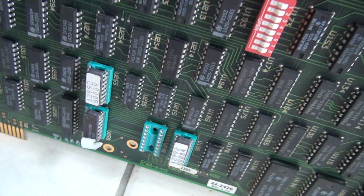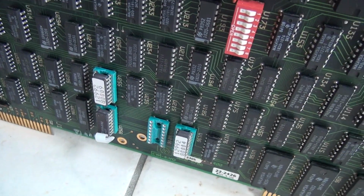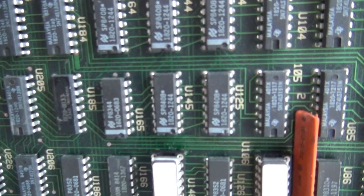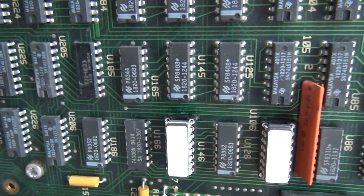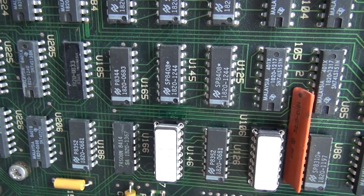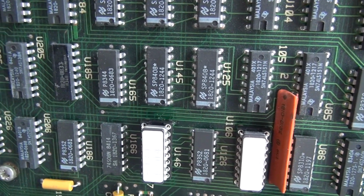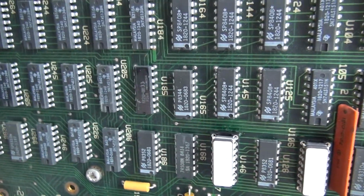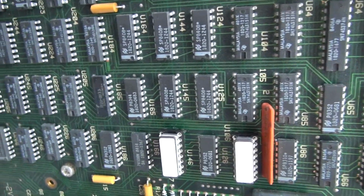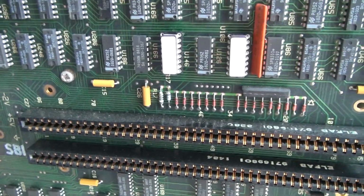18160782. This is of course not the real manufacturer's part number. This is the HP internal stock number. So as you can see, all these have these numbers. I mentioned it in a previous video as well. So they also have these 8-digit numbers, which is the internal stock number. Some of them do not even list the real TTL, SN, whatever number. So you have to look into a cross-reference to really know which part it is. So that's what we will do next.